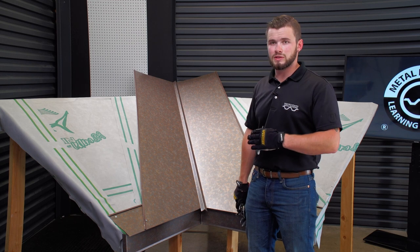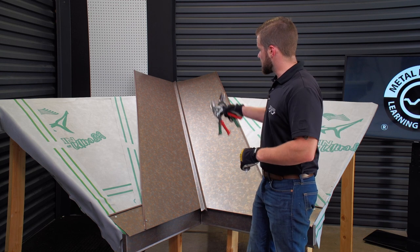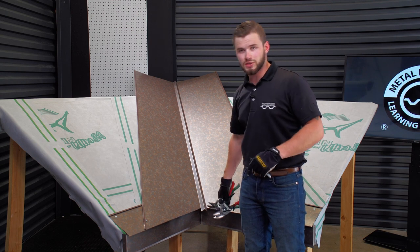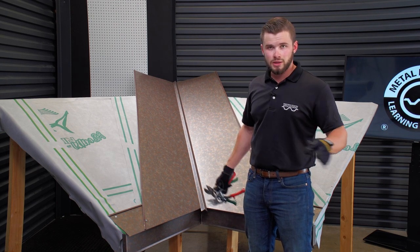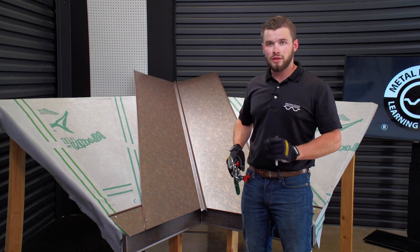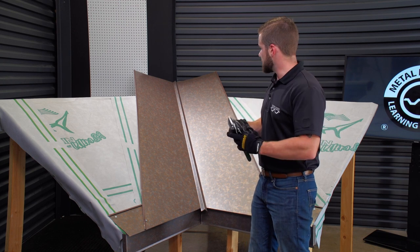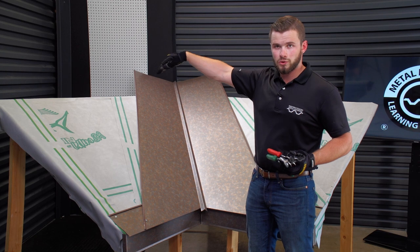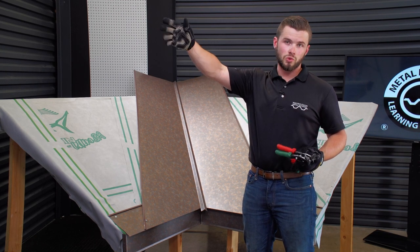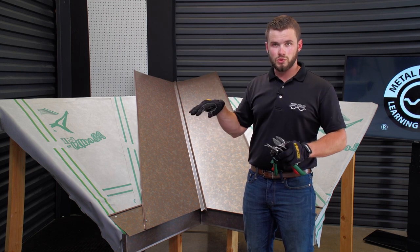Since we're basically installing this on a single-pitch roof, I'm going to go up to the top and trace out everything just like I did down here on the bottom. You can leave your two inches up there to close off the top, and your top peak trim will come together on the corner. If you're running a valley-to-valley condition — for instance, a dormer — you're going to want to fold the top down over the other valley and run the W of the valley usually close to two feet long, so that when you come in with your next valley pan, you can run those two Ws in together.